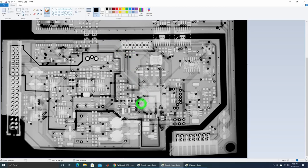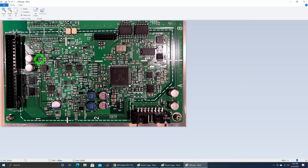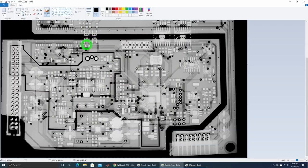There's a big IC here in the middle - you can see the capacitors - so this is almost definitely a DC-DC converter. Looking at this I'm fairly convinced this board is powered through the connector at the left. You can see 1.8 volt written here, 3.3 volts written here, so we will definitely be able to check those. Here are the opto-isolators that you can see in the x-ray. So we have a lot of information - we can put this board back into the instrument, make some measurements, check out those power supplies, and even find out if there's a way to run it just by itself.